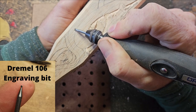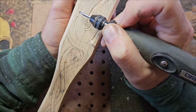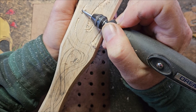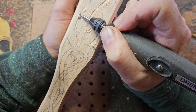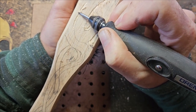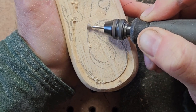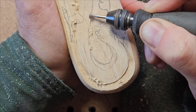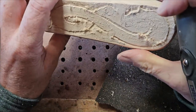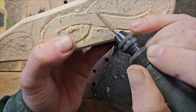I've got a real small ball cutter bit just to show you that you could do it with this as well. It's best to go from left to right with the actual rotation, because going right to left you can see it just builds up that fluffy wood — it also kind of digs in a little bit more. You could use a diamond bit if you wanted. What's nice about this is it gives quite a nice line, but it's not going to go around those really tight corners. You could even use a chisel but the finish isn't going to be great, though you can carve away quite a bit.